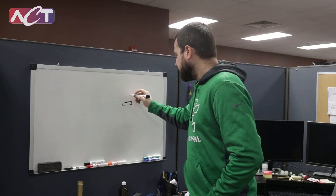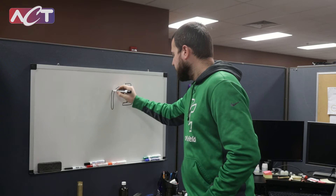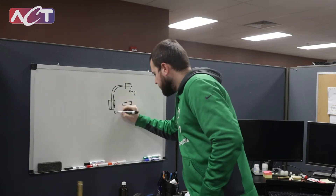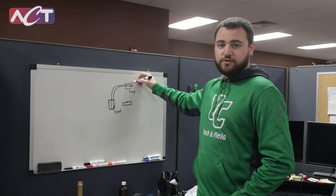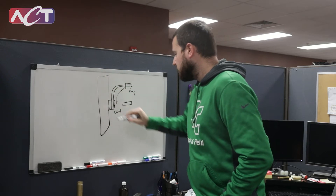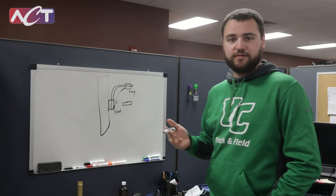A block pipe block heat pipe is going to have a square copper block with your heat pipe running through it — this is just a general shape. Then you'll have another block on the other end: this will be your evaporator, and this will be your condenser. Essentially you'll have the evaporator mounted directly to your component, your heat input going into the evaporator, and that will be moving all of your heat towards the condenser. That condenser might be mounted to your bigger chassis wall or whatever is going to move your heat from your component level out to your higher-level systems level.